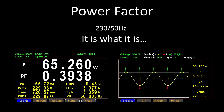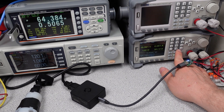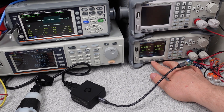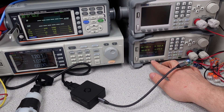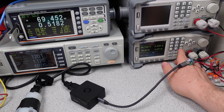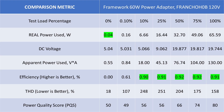The story at 230 volts is not better, but the detailed data will be covered shortly. Overload testing checks when the device safely shuts down when too much power is drawn, which can happen from a short circuit or misbehaving device. The power adapter tripped on overload at 66 watts — a safe limit and not cause for any concern. The adapter also recovers after an overload. The voltage levels were okay on this power adapter; each mode held within the tolerance of the USB specification. This shouldn't have any issues powering lots of devices.